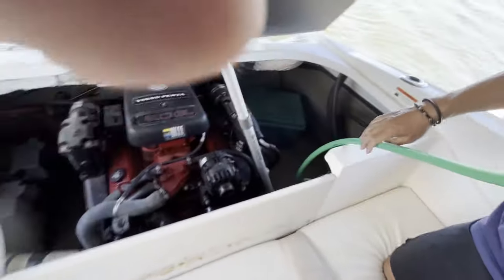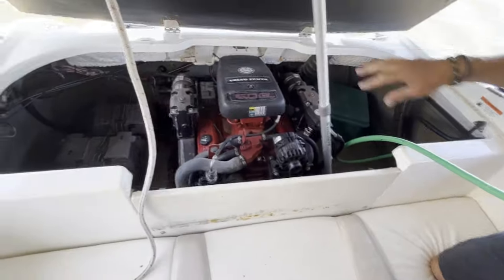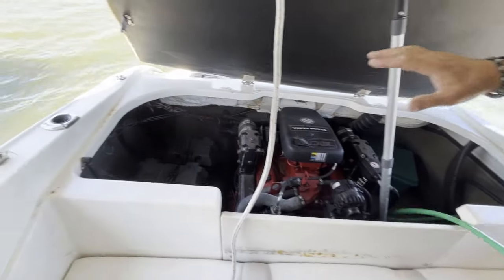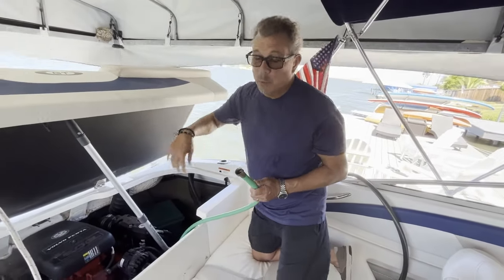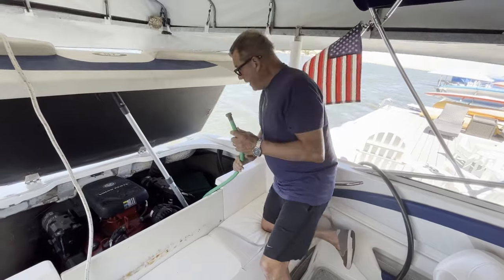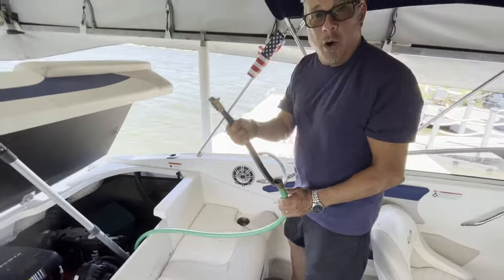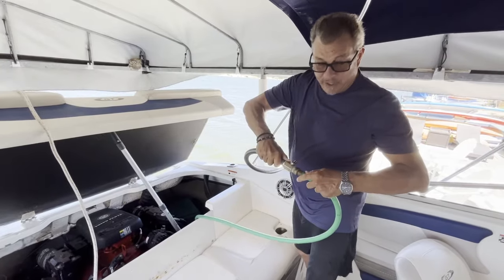This hose inside the engine compartment our mechanic set up goes into the engine block and will flow water through the engine — water that normally the engine sucks up from whatever water the boat's in, which in this case is salt water. We don't want to put the boat to bed with salt water in the cooling system. We want to flush it out with fresh water after every use for about two minutes. We take this hose — it's on but the valve is closed, which is really convenient for hooking it up.